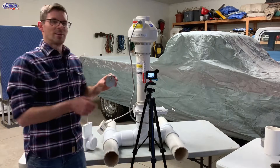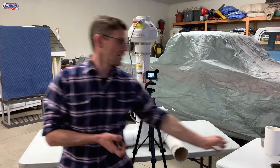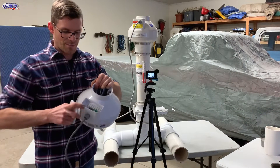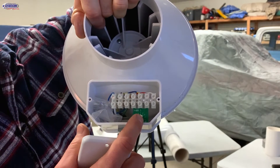The reason that we use these is it allows us to balance your radon mitigation system. It's especially helpful when you're not using an EC fan that has a potentiometer inside of it that allows us to dial in that radon fan to exactly what we need with the ease of just using a screwdriver.